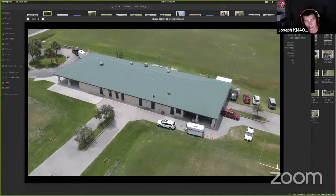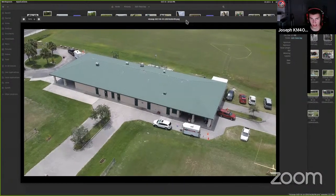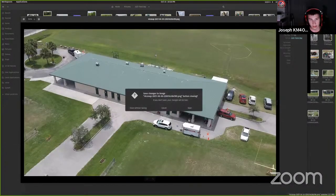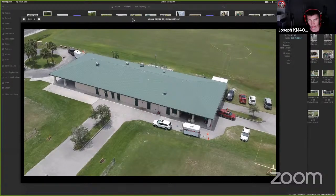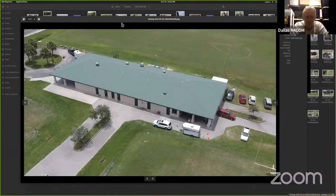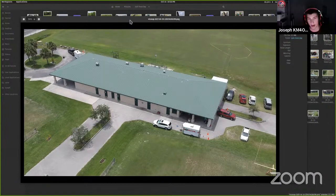Technically, this is interesting. They don't tell you you have to have a ham license when you buy this. They tell you a lot of stuff about drone safety and regulations, but they don't tell you you're supposed to have a ham license. So I wonder if that means the signal is licensed some other way with the FCC. It must be. You know what bands it operates on? Yeah, it operates on 5.8 gigahertz and 2.4 gigahertz. Well, that's because it's in the Wi-Fi stuff. It may be under Part 15 or something like that. Yep, it might be.